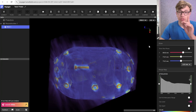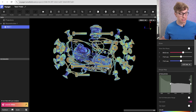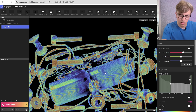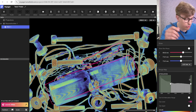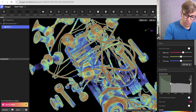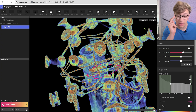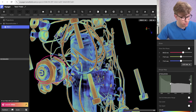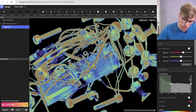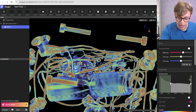Let's dig into this absolute mess. Here, laid bare, is the potato. Quite a bit going on in here, actually. Let's go through and enumerate what we're seeing, and then go back and try to actually explain what it all does. We have a battery, an Arduino Nano microcontroller, a transformer hooked up to some form of high voltage converter, and some butt connectors. We've got one light-up power switch. We've got a transistor — that's going to be how we're turning the voltage converter on and off. And sandwiched on the Arduino, but not directly attached, on top of the Arduino, we have some other circuit board here. I don't know what it is, but we're going to figure it out.